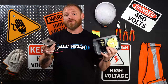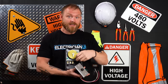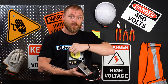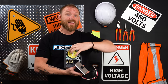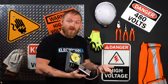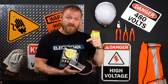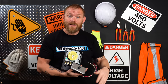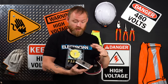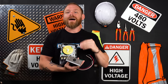Let's talk about the dangers of working with automatic devices. If you are working on something that appears to be off but the timer is still active, every time that tripper comes to its set time it's going to change the state of the circuit. People have gotten shocked because they think something is off, and then it gets darker out and all of a sudden the photocell kicks on and all of those pole lights they have their hands in energize.